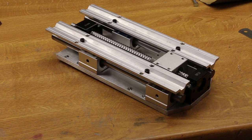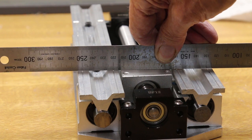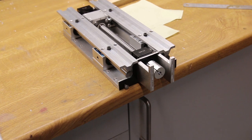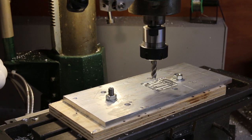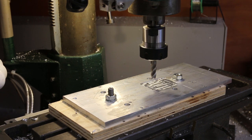The next step is to mount everything for a trial fit. Going by the published dimensions, these should all be at the same height — but as you can see, there's a bit of a gap. So I'll need to make a recess on the plate to allow for this to fit. There's not a great deal of room, so the motor mount ended up a bit more complicated than I would have liked, but there it is. The Z-axis plate is machined out in exactly the same way. The one difference is the surfacing you can see I've done — this is half a millimetre deep. According to the drawings there should be a one millimetre gap between the part that fits here and the plate, needing a shim, but in practice it's about half a millimetre oversized. Something wrong with the drawings or the parts.